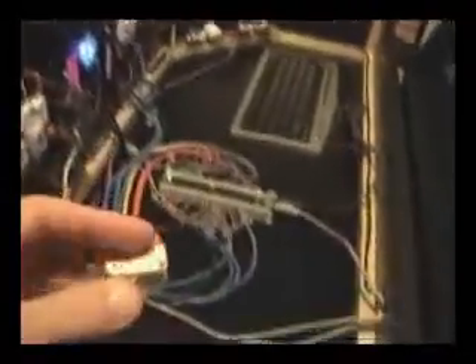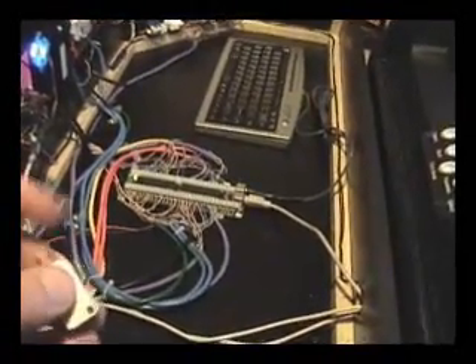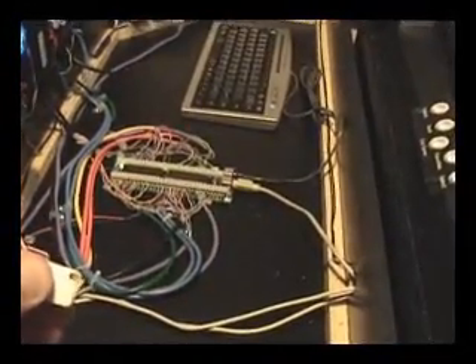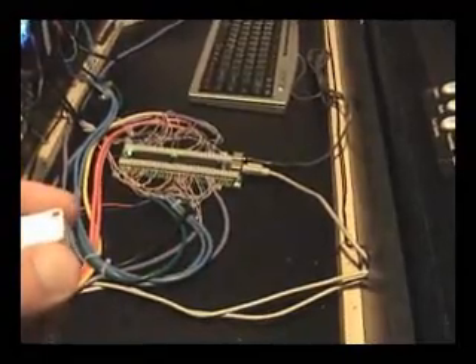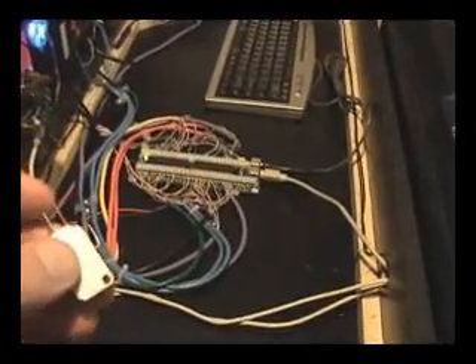This is button number one. First thing you want to know when hooking up a microswitch — this is a microswitch right here — ground always goes to this one on top. There are two pins you can connect it to; you want the one closest to the ground. There's NO and NC, which stands for normally open and normally closed. If you connect to NO, the button is open at all times and pressing it closes the connection to fire whatever you want on screen. If you connect to NC by mistake, it's always closed, meaning you press the button to open the connection — the opposite. So you definitely don't want to do that.